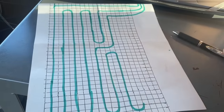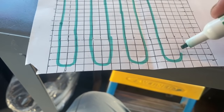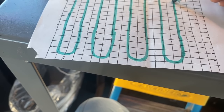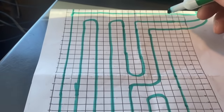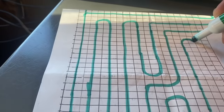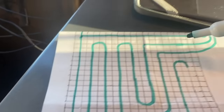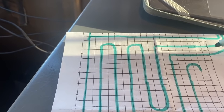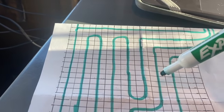And you're going to do the same thing again. We're just going to continue these long loops. Back up through like this. Just keep going. Now you're back to a little bit less now because we've got these lines here. So now when we get up to here and we turn, we're gonna stay back away. So these loops here are shorter than when we started. And also we had to go all the way down to here before we started. So the second loop, which starts here, we didn't have to go all the way down to the end of the building. We turned here and started.